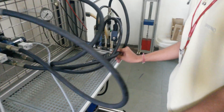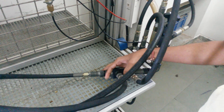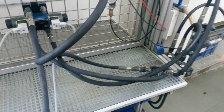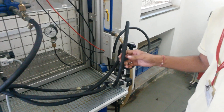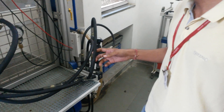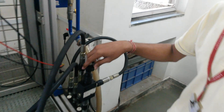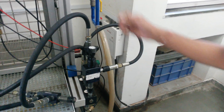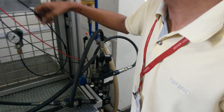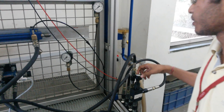From here the line again goes to the connector pin, so both connections are taking place. This helps in completing the circuit and helps in increasing the speed for the forward stroke, but for the return stroke the speed remains constant. By adjusting the pressure in the relief valve, we can adjust the system pressure. This is the pressure gauge for the inlet side of the hydraulic cylinder actuator, and this is the pressure relief valve for pressure relief setting.